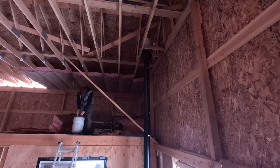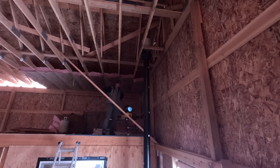Once I got that all connected and warming up, I decided to take a few minutes to run the last bit of in-wall wiring that we had planned. After a little bit of discussion, we had decided that we would close in a room underneath the stairs where we would house the air compressor as well as shelving and things for inventory items like bolts and nuts and filters, and I'll likely keep my chargers for my cordless tools in there as well. So I'm pulling in a separate circuit for the air compressor as well as a main circuit for the power and lighting in that small room.